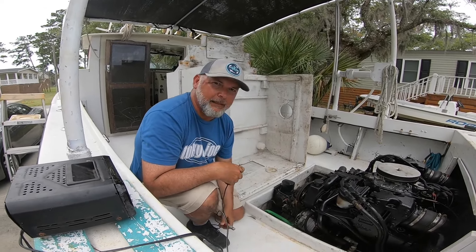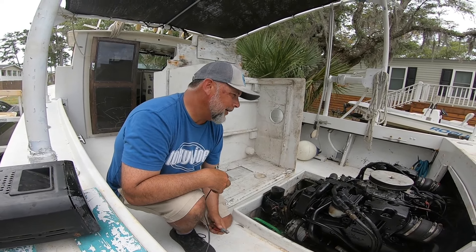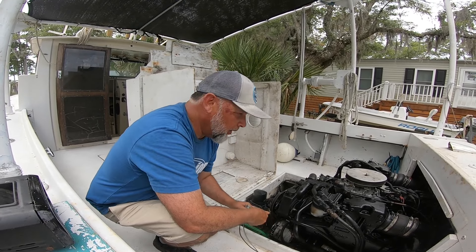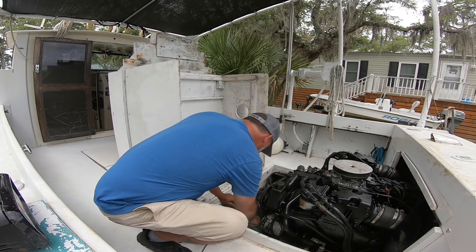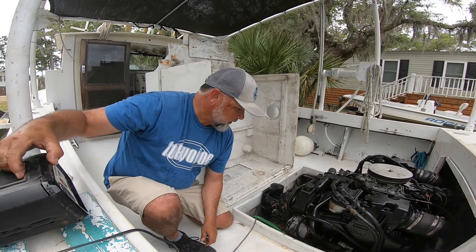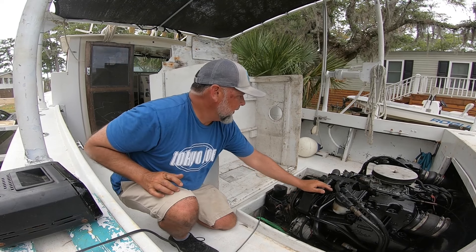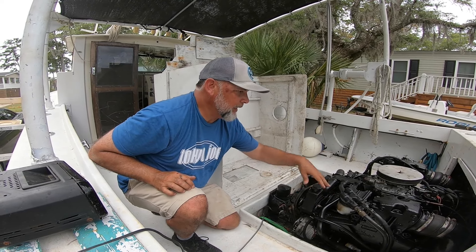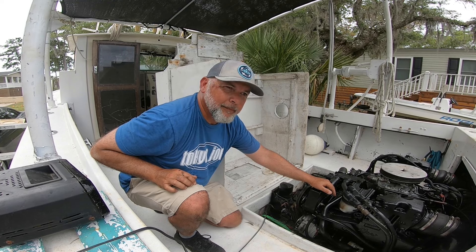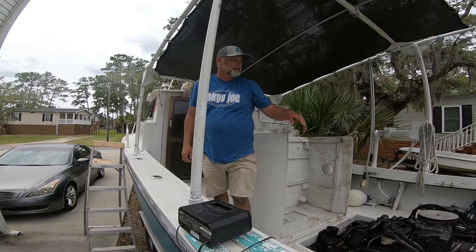I really don't think this battery charging is going to help much. When this motor went out, we were moving along at idle speed - about seven or eight miles an hour - and heard a banging in the engine like something had come apart. Anyway, we're gonna hook this up and start charging the battery. Both batteries are connected so they'll charge at the same time. We'll come back later to test this thing again and see if it'll spin over. The chances are it won't, with the water being in the oil - you've seen the milky brown chocolate color. The only other thing we've got to look at is the outdrive.